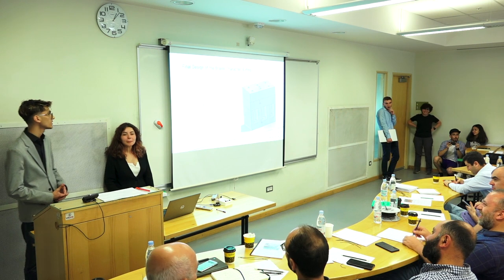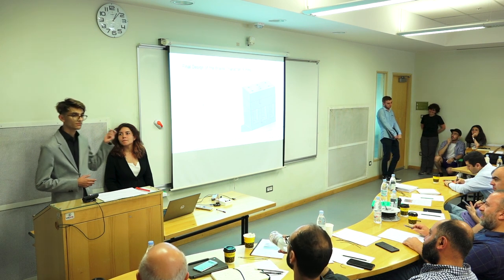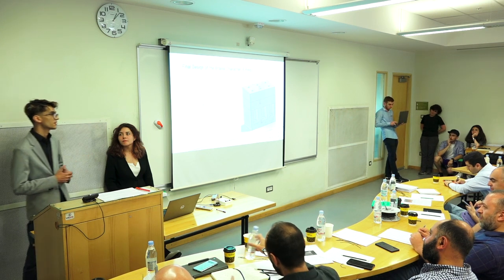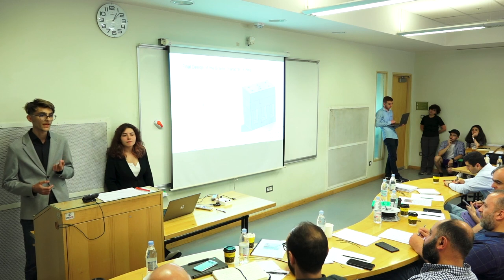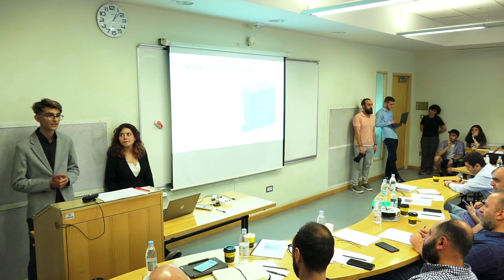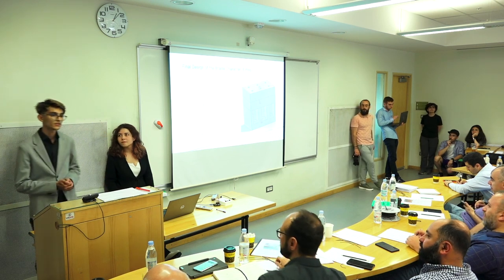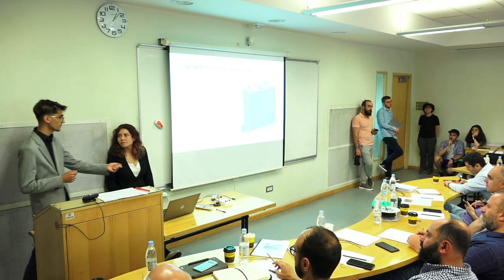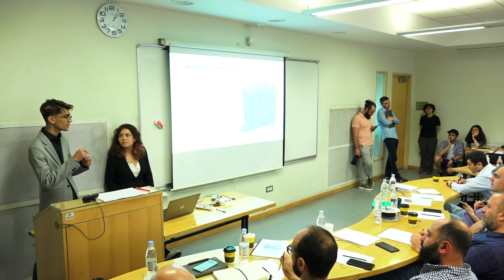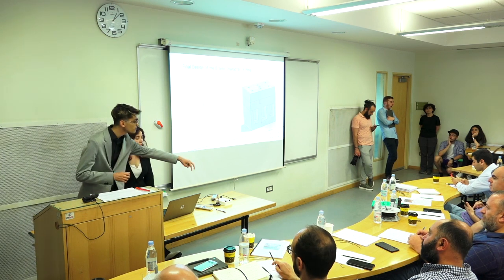If we get access to a lot of industrially made products, it will definitely make a lot of things easier, because the magnets might be a bit strong. We might need much weaker magnets, but there is not a lot of production out there for this size of magnets, and now we're trying to be picky about how strong the magnet is. There are a lot of finicky things like that that we would change if we could. Same thing with the coils. We tested it after we finished this tablet, and we realized that we could even make the wires a bit thinner. That will change the size and might bring the pins even closer.